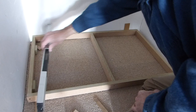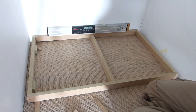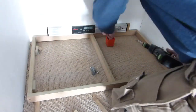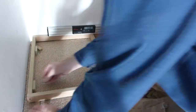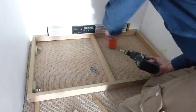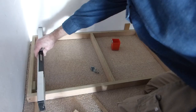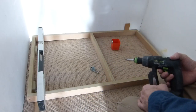Five hundredths of a degree this way as well, so that's all good stuff. With our plinth levelled up on hardwood wedges we can screw the brackets through the carpet and into the floor, then fix the little MDF feet to the plinth and then the brackets to the feet. And of course we check for level again when we're done — incredibly, that's still bang on.